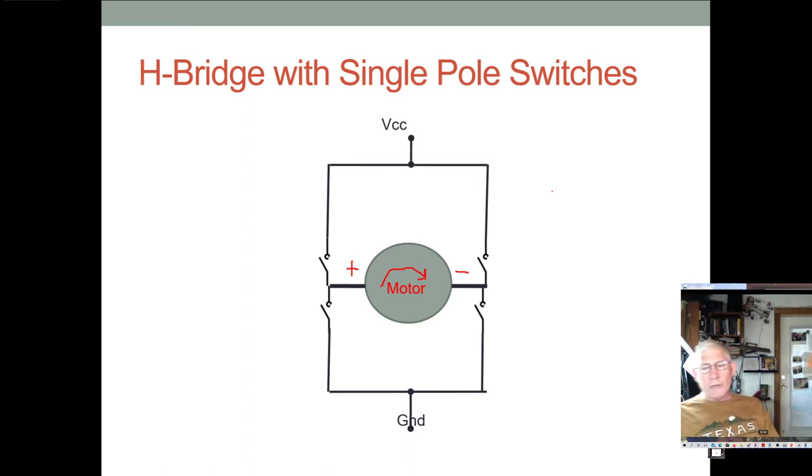Also, as you decrease the drive voltage, the torque goes way, way down. And so there's very little power, and at slow rotational speeds, there's almost no power. So a drill basically doesn't work when you try to control it by its RPM by varying just the voltage. What you have to do instead is vary the duty cycle and give it full voltage or be fully off. All you do then is vary the percentage of time that it's fully on for each duty cycle. And then you repeat the duty cycle at a pulse repetition rate that basically fuses the motion, so you don't see it, so the motor's not actually operating in spurts.